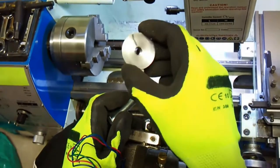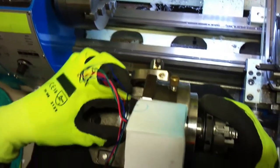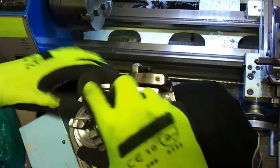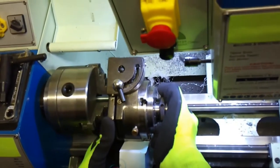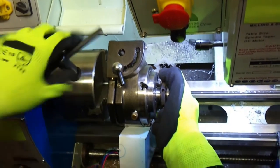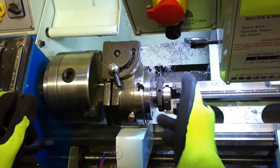And this is the finished result. We have to put it on the rotary table for indexing. This is a piece that I made on the lathe — this adapter with a bolt over here. Lock it like this, put this in this hole together, close the rotary table, lock it, and now put the whole rotary table inside the lathe and lock the lathe.